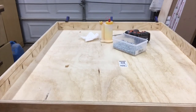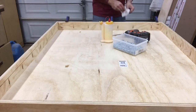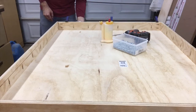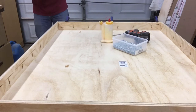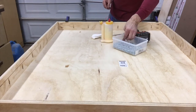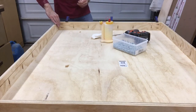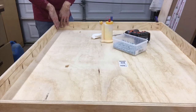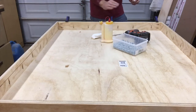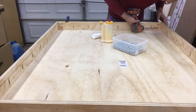What I was doing was lining up my sides perfectly with the outside of the plywood, and I must be a little off on the plywood. That means I'm going to have a gap on one of these sides. Well, that's all right. I think it's going to be plenty strong enough. When I do my legs, I'm actually going to do a two-piece plywood, so it'll be a V in here, and it'll get held together at that point. So I'm not worried about the structural integrity.